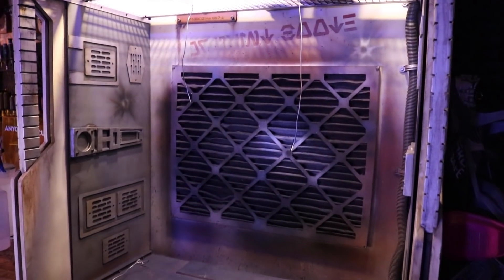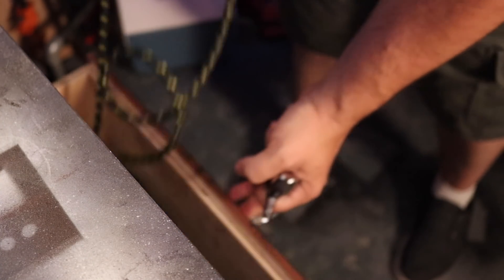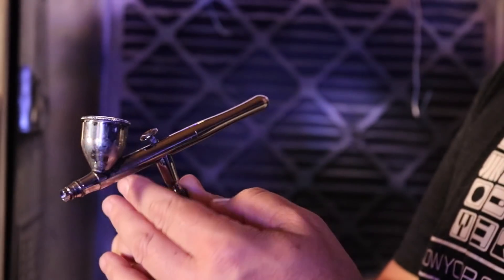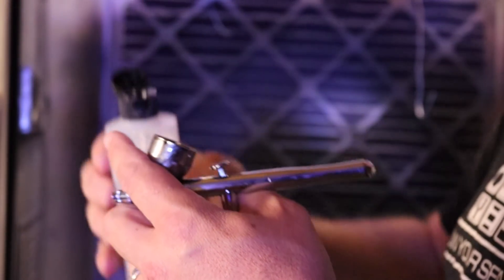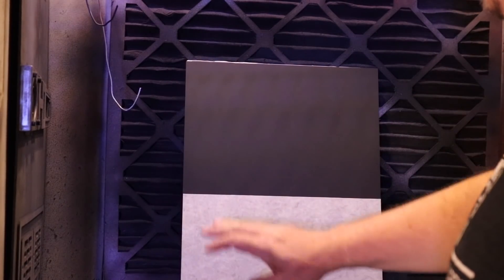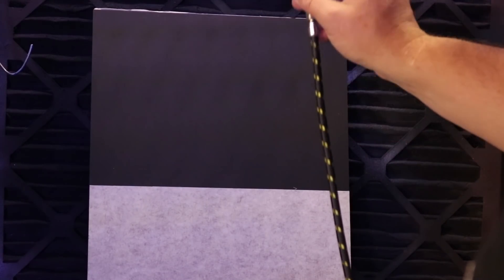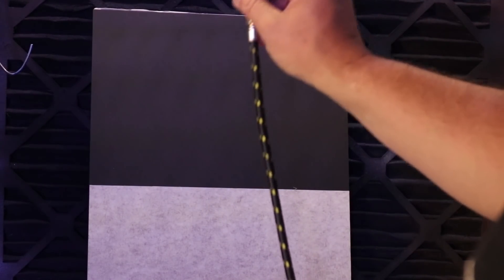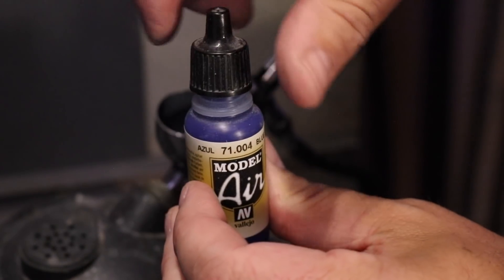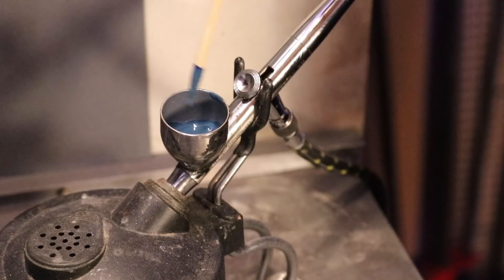This all starts with a simple enough design. I found reference for the control panels that I liked and then I drew it up best I could in Adobe Illustrator. Before we could take this to the laser cutter, I needed to lay down a base color — in this case, it has a slightly blue tint. The reason for the base color is that I want to utilize my laser cutter to help me mask all the pinstripe lines in the design. So if I paint the acrylic first, then cover it with a protective paper, I'll be able to remove just the areas I want pinstriped, which I'll show you here in a bit.